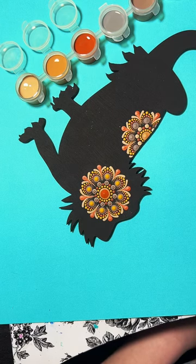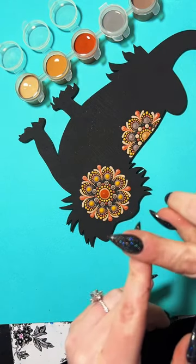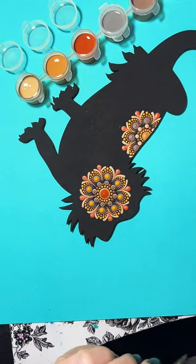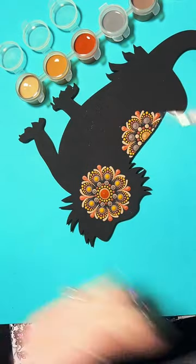But you can use a glossy varnish too, but you're just not going to get that glass-like finish. Yeah, so resin cures just fine on wood. UV resin is where you want to be careful on wood. So UV resin, you need to seal it. And I wouldn't use UV resin on something large like this, because that's just going to use up a lot of it.